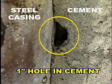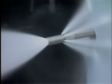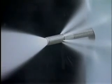The C5 ball cutter not only bores a hole in the casing, but also penetrates deep into the cement behind the casing. This creates a fantastic starting position for the patented Buckman nozzle to jet drill into a reservoir.